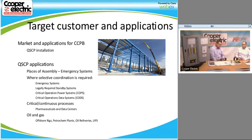The size is a big factor in getting it specified in some of the OEMs that we have around here, because the size is much smaller than our normal FRS-R30. It's a much more compact design. So if you look at just the difference between an FRS-R30 in length, and especially once you put it into a switch, it's a much smaller, more compact design, so we can use it in a lot of different enclosures that are smaller now.